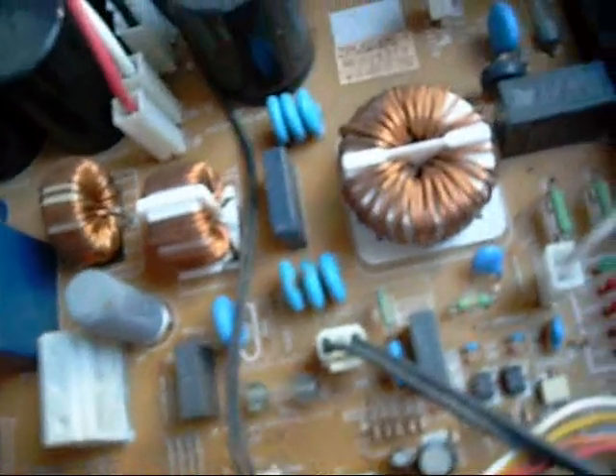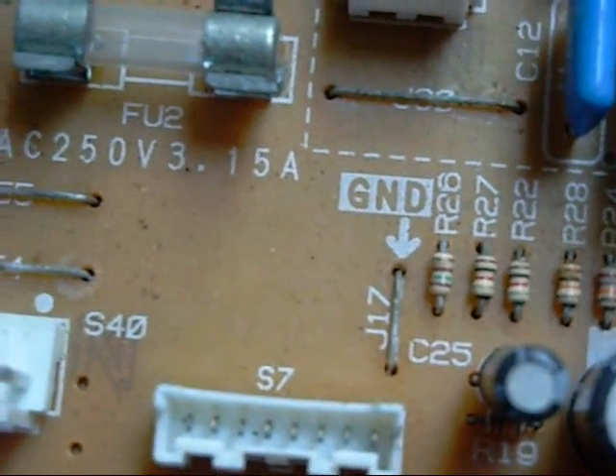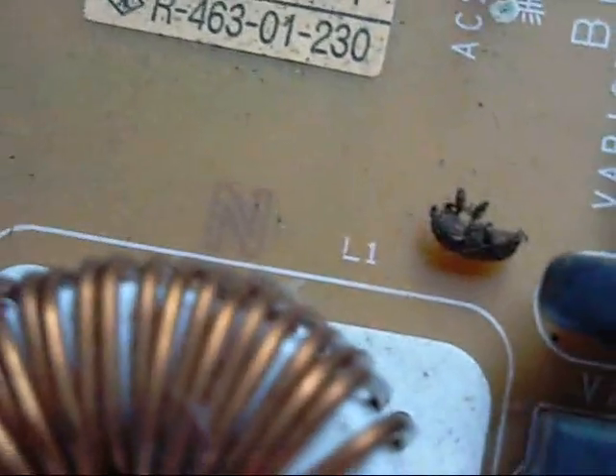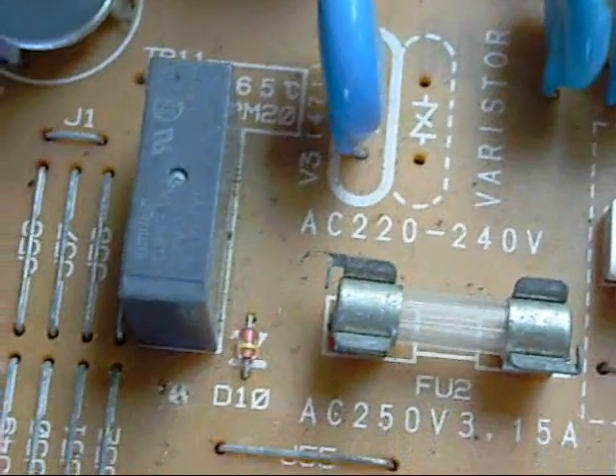It's like it's trying to start up but it can't. I don't really know where to start with troubleshooting one of these - I'm going to take it out and turn it upside down just to check the solder joints. The last one had a few funny joints on it. There are definitely signs of a lot of moisture in here as well. Moisture ingress in this unit is very evident - you can see a lot of corrosion on the wires, a lot of burnt ants around the AC inputs. Some moisture and pests have really gotten into this one. There's some spider poop - it looks like burnout but it's not.